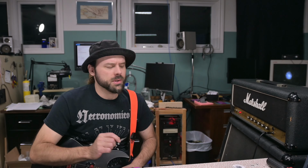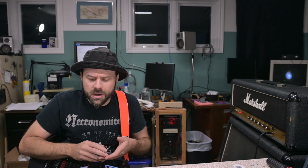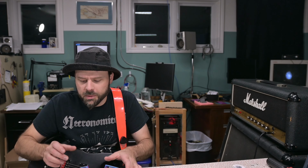They sound so similar that I almost want to say, don't bother getting the specialty capacitors. If you just want to bang one of these off, totally just get normal capacitors: ceramic MLCCs, electrolytic, ceramic 100P. Just build the darn thing. And if you really like it and want to try to exercise that more authentic vibe, then by all means, build another one with the other capacitors.